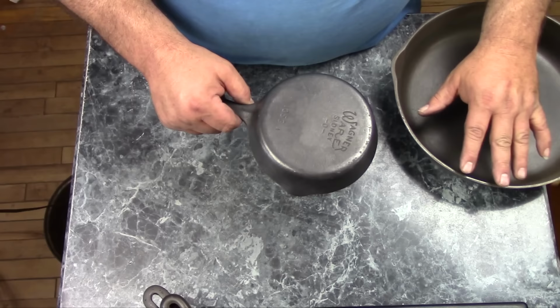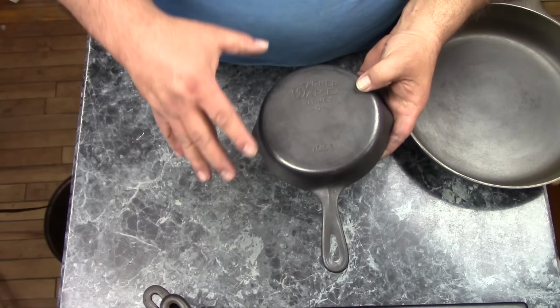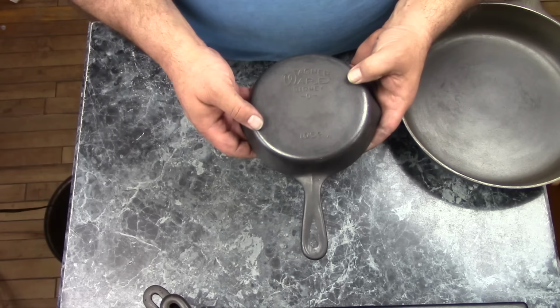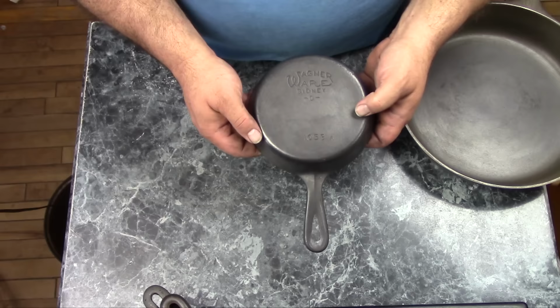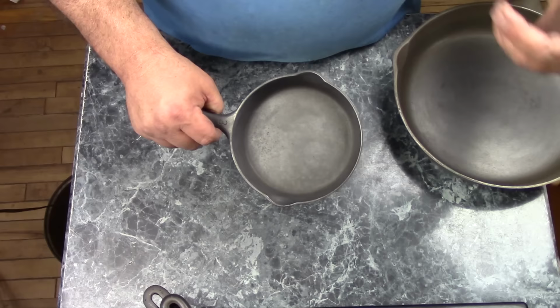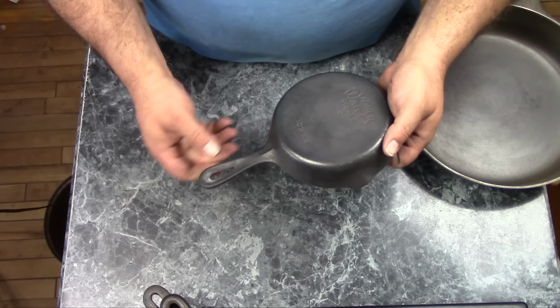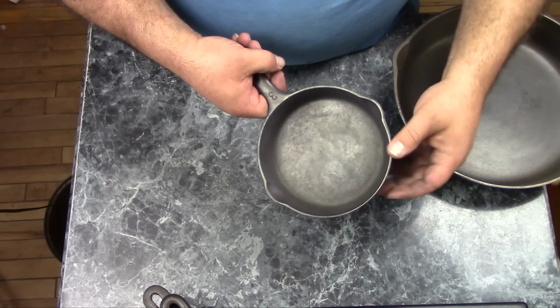This was in, like I say, for 4 hours. Electrolysis works by a couple of different means. First, the bubbles will help to physically loosen any crust and crud that's on the pan, any loose rust, and it'll just kind of flake it off. The slightly alkali solution from the calcium or sodium carbonate helps to dissolve any grease and oil that's in any crud that's on there. And lastly, it chemically changes the rust. The hydrogen and electricity remove oxygen from the rust, and it turns it back into either black iron oxide or back into iron. So you get a nice dark, clean, smooth finish with no rust on it.